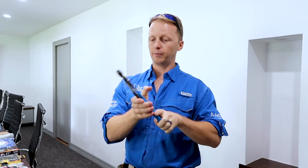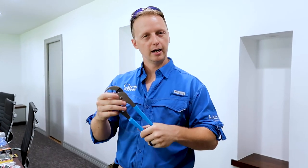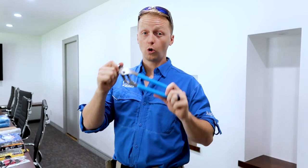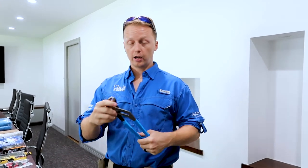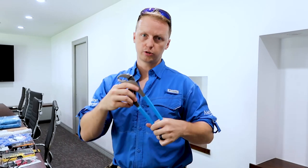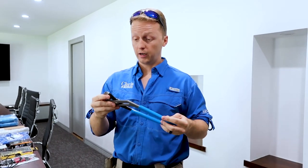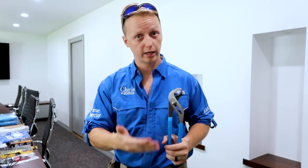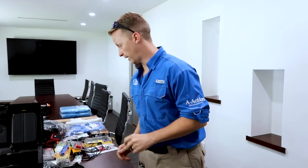The next item is the plumber's wrench. The reason I carry this is because I've had water lines break while I was inside a property operating things. A lot of people say don't carry it, but this is to shut down things that break while you're doing the home inspection — because sometimes you're inspecting things people have never touched. If you start operating a faucet and it shoots out the wall, you need a way to shut the water off.